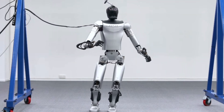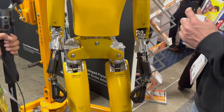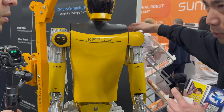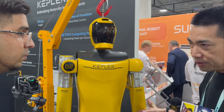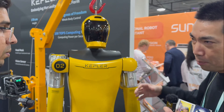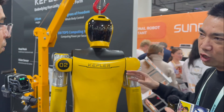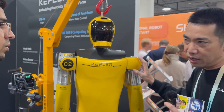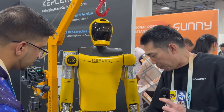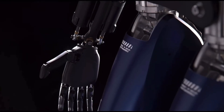In terms of the actuators, what kind are you using? We basically use two kinds of actuators. One is the rotary type, used on the joint places. The other is the linear type, which goes in a straight line and is used in the muscle places. There are 14 pieces of each, so 28 actuators total on the body, plus another 12 degrees of freedom on the hands — so all together 40 degrees of freedom.